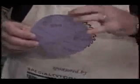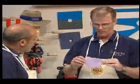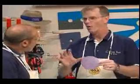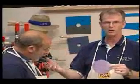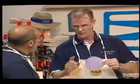So, once again, I realize that dust collection isn't critical if you're wet sanding. Right. However, one of the nice benefits to this hole pattern is you can either dry or wet sand. And if you wet sand, the perforations prevent the disc from generating any sort of a suction or a vacuum. Now, is this a silicon carbide paper, or is this aluminum oxide?